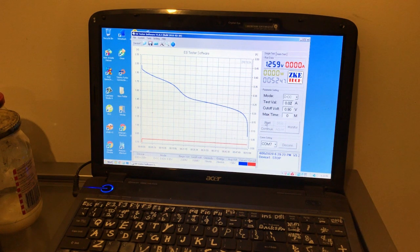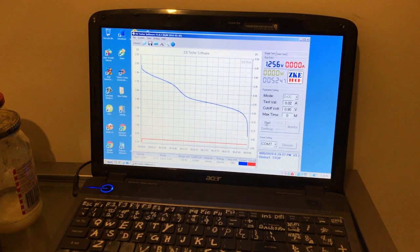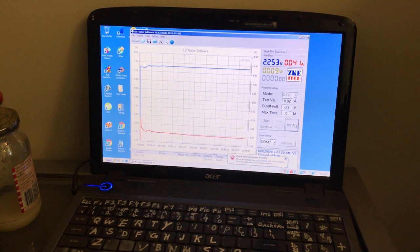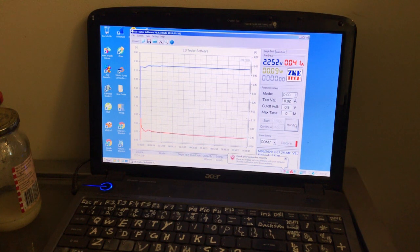I'll go round two tomorrow and test them again to see what happens. I have a higher voltage bounce back at 1.2 volts. Back the next day — I've got the manganese dioxide one on charge for an hour. Yesterday's run was 52 minutes with an hour's charge, so let's see if it's improving. I found the cell today at 0.2 volts, dropping faster than the others. This one is activated carbon on the negative side with manganese dioxide on the positive.